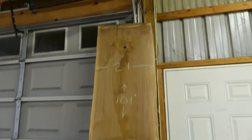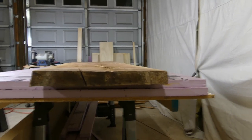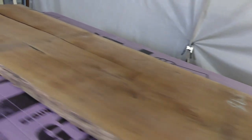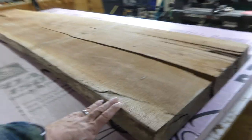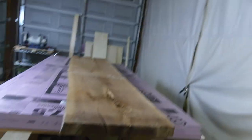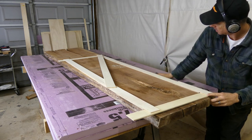When I was contacted I went out and picked this slab out. Only about 60 percent of it is usable for this job because of that big check in it. It's kind of perfect for this job — it's five foot three inches wide, so that just gets into those checks a little bit. I'd kind of set this thing aside for a couple of months; I sell slabs and said it wasn't available because it's got this big check. It's also got a bit of a twist and a rotten spot. After consulting with the customer and the designer, they wanted the rotten spot up so we could dig it out, fill it with epoxy, and get some color into it.